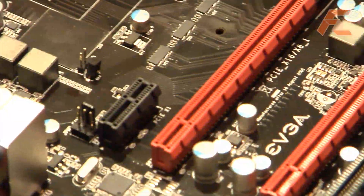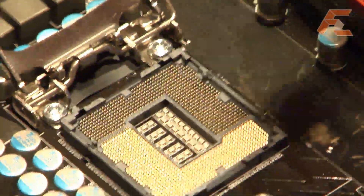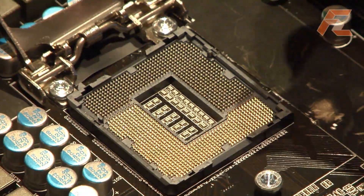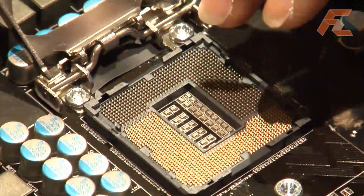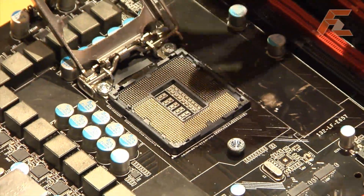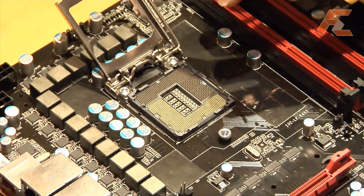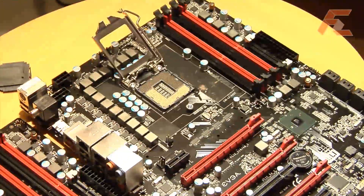These are a higher grade of surface mount capacitors, good at transient responses. The main thing is that their beauty lies in their low inductance. For capacitors, you want as low inductance as possible, and these caps are the ones for the job.